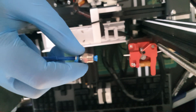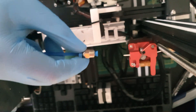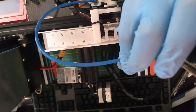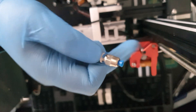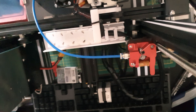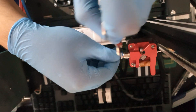What you will then do is always connect this extruder side first, then connect the bottom tube from your hotend, because this tube will not be able to move anymore. If your hotend is installed first, it will try to rotate and eventually rip your tube out of your hotend. So just be sure you always connect this side first. Note that the washers are inside and bottomed out - I have four installed. I'll wrench this on securely - as you can see the tube is moving with it, which is why you don't want the hotend connected yet.